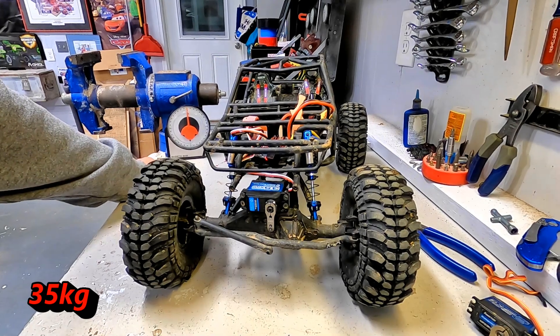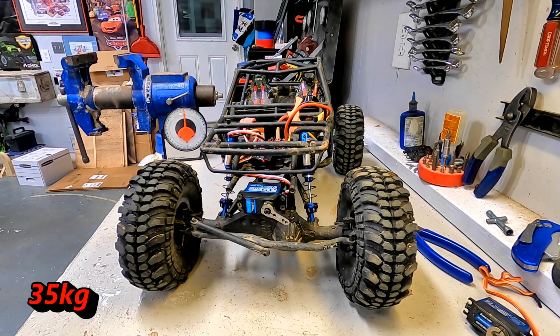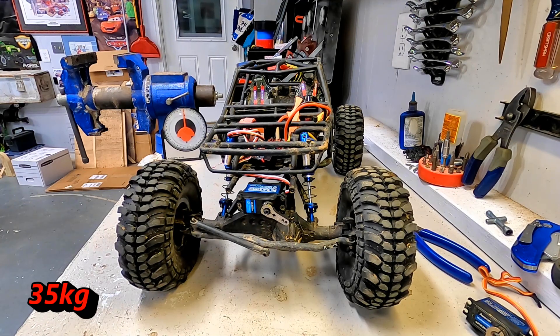New 35 kg servo installed, new fancy servo horn also installed. It does pretty good — turns both directions nicely. Unless I'm missing something about how this stuff programs, this was claimed to be a 270 degree servo, but maybe there's some detail I just don't know about when it comes to how servos work. Either I'm not telling it to turn 270 somehow, or it just doesn't do it. I'm glad I didn't buy the 180 because I could clearly turn down my endpoints from here way down and limit how much steering I have. This is me turning the endpoint adjustment knob — it's maxed out on my endpoint adjustments, and it turns dang near 180. So that's actually pretty good.